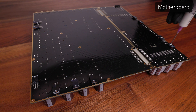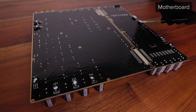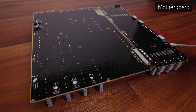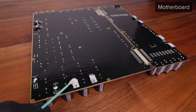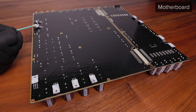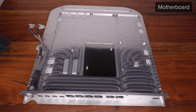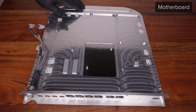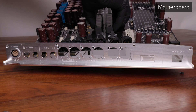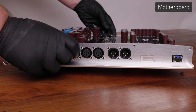Before putting the boards back into the metal, apply non-conductive, non-silicone thermal compound to each of the ten devices under the motherboard. Only a small amount of compound is needed — too much compound is not good for proper heat transfer. Next, check the base metal to ensure that the three thermal pads are still in the right locations and that there is no possible loose hardware to get trapped under the boards. Place the board back into place by sliding the connectors into the jack panel and then setting it flat on the base metal.